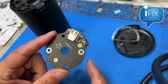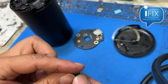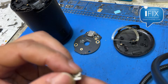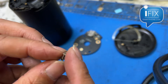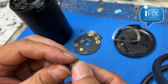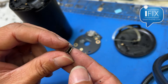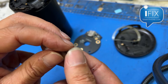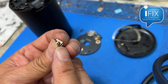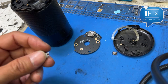So this is the charging port that was actually on this board. Even though it looks okay, internally the pin was broken — you can put it in and if you wiggle it, it just doesn't do anything, indicating breakage inside. This looks like the good old BlackBerry 9700 charging port, but it has a long leg, so you can't even get those parts anymore.